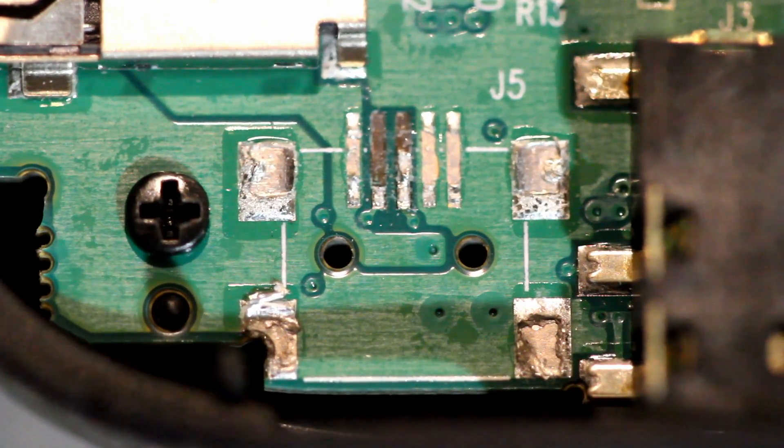You don't need a super fancy soldering iron, but I have a digitally controlled, digital temperature controlled one. It's not strictly necessary, but it does help. The problem is if your iron is too hot, you can actually do more damage — you can actually burn the rest of the trace off of the board. The moral of the story is you do need some specialized equipment, but the thing here is it's already broken — you can't break it anymore. So if you have a soldering iron and some way to magnify to see it, give it a shot. I still have the original power connector, so I can just clean off the contacts, clean all this old solder up, and I should be able to reuse it. I can't really film the next step, so we'll just have to come back when I'm done here and see what I've done. We'll be right back.